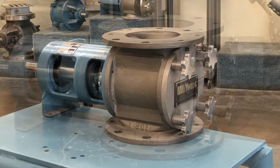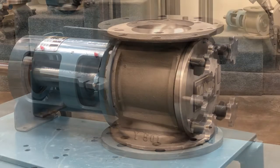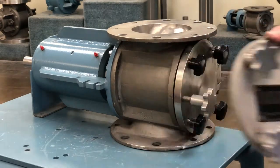Young Industries quick clean rotary valve offers a unique cantilever design, having two bearings on one end of the rotor shaft. The rotor itself is cantilevered from the bearings on the shaft and is completely removable from the valve on the opposite end of the housing.